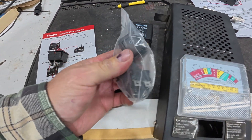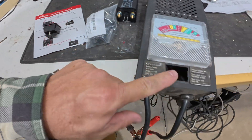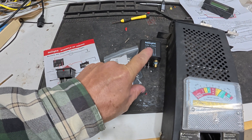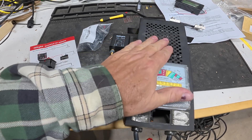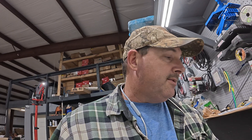I'm going to put a new momentary switch back in the unit and have it actually energize through the relay, so the switch doesn't have to transfer the entire load. I spent about $19 on these parts. I could have just bought a brand new one at Harbor Freight for $19 or $20, but it's done the same way — uses a very low current switch that will eventually burn up trying to transfer that much current. So let's get started and get this installed.